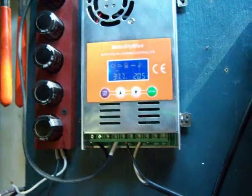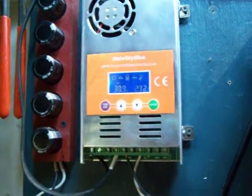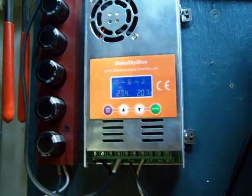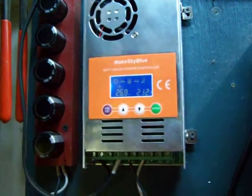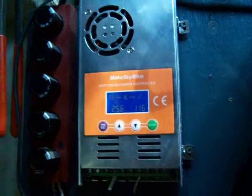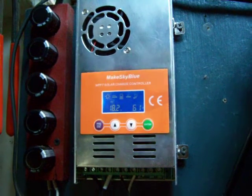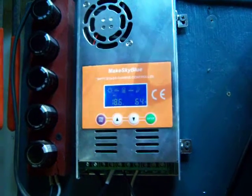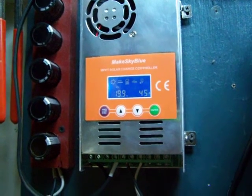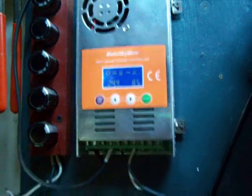I'll come out in the morning and look at the panel voltage and it'll be 19 volts. It's a 60-volt system, so it should be between 50 and 61 volts for power point. I just disconnect the panels, plug it right back in and it starts working again. It was like 77 watts going into the battery at 19 volts, then after reconnecting it immediately went to 61 volts and 125 watts. I don't know what's with that — I can do a microprocessor reset on this thing, which I might just have to do.